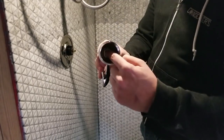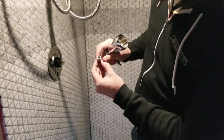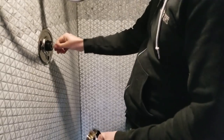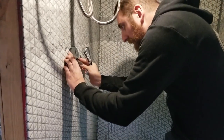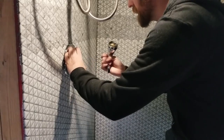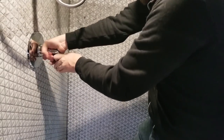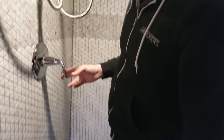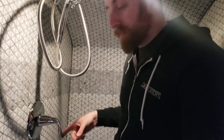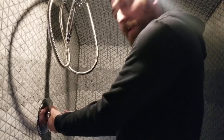This handle has a square bit inside, so I have a square adapter that came with it — it's got a star shape on the inside that fits right over the spigot. I'm going to put the final piece on the outside. This should be perfectly vertical. If I did this right, I should feel some resistance as I push it and it stops, so I know it's hooked up right. And that's it. If the shower was running, I'd be spraying myself in the face right now with hot water.